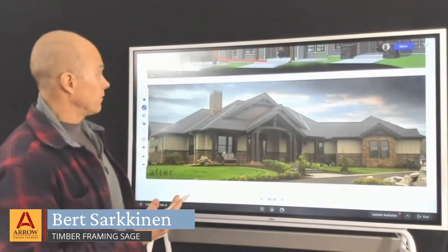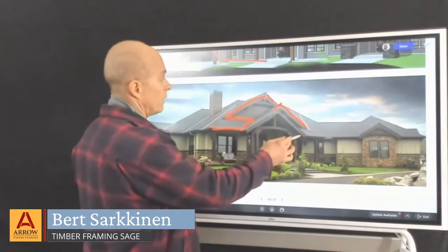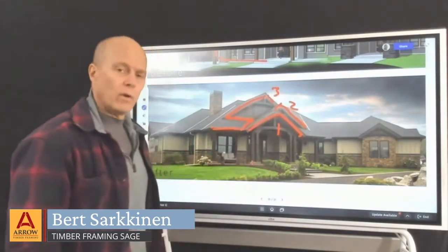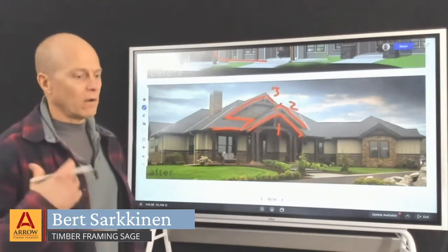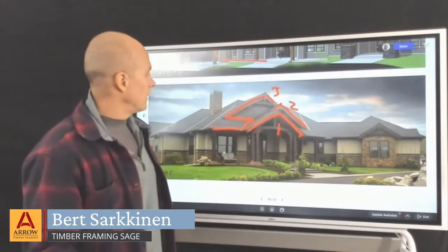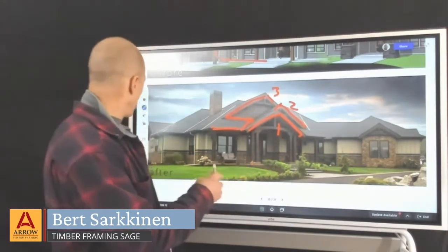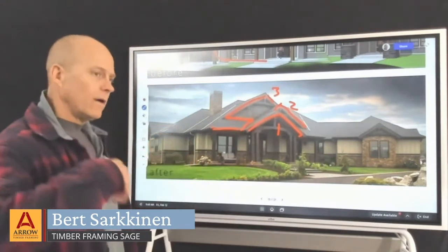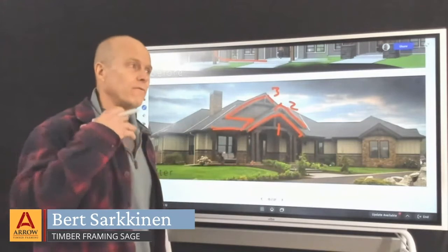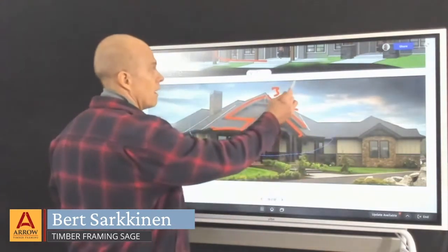And what we've got here is we just eliminated two gables, did a Dutch hip, and created these gables that play with each other here. So the main one is here, step back. And so 1, 2, 3. 1, 2, 3 is really a common thing with interior design, architecture, creating a theme. Things come in threes and generally odd numbers. Sometimes we'll jump to 5 if that's what fits. And it's not to say that 4 doesn't fit sometimes. It's always testing with quantity of ideas, and you just get to wiggle in and see what works. And the design truths that come through help us get to something that's visually pleasing and that fits the bill for someone's style faster, but it still is a lot of trial and error, mostly error.